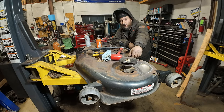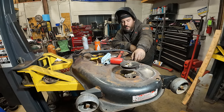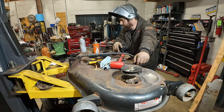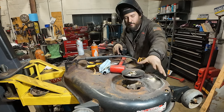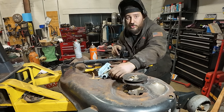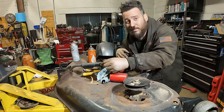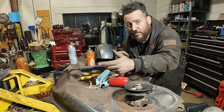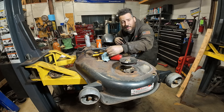That wraps up another Side Job Saturday here at the Spank Ranch Garage. This was supposed to be like an hour job — it ended up taking almost two hours. Stupid spindle problems, my own recklessness causing damage. Pretty much just wasn't the smoothest job. But this deck is all patched up. The customer's going to hit it with rust converting paint. He really needs to get a good coat of paint on this to protect it. I told him you've got to be pulling these pulley covers off and blowing that out. Every time I'm done with my lawnmower, I blow the whole top side of the deck off with a leaf blower before it goes in the shed. My mower is about 24 years old — it's more of a commercial model with an eighth-inch fabricated deck, and even that rotted through on top. So blowing off the top of your deck is so important. Either hit it with a garden hose, a leaf blower, whatever you've got to do. Thanks for watching Spank Ranch Garage. See you next time.